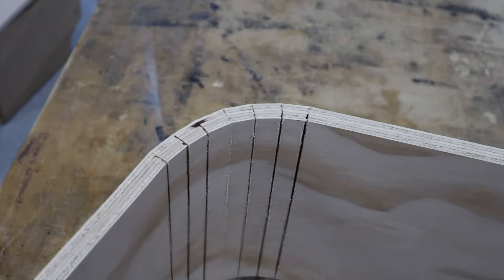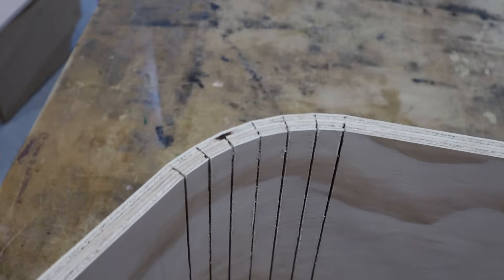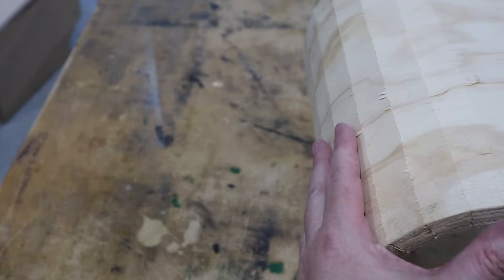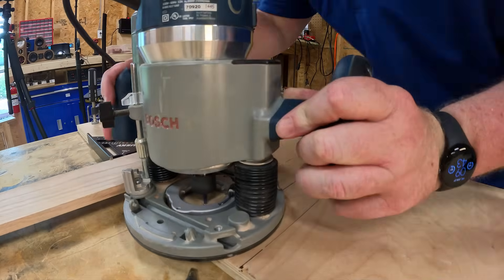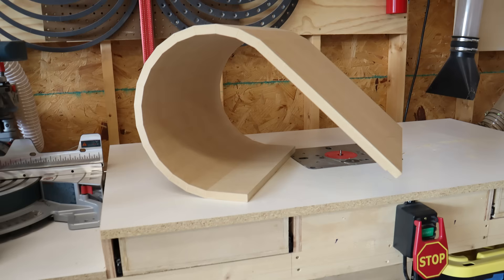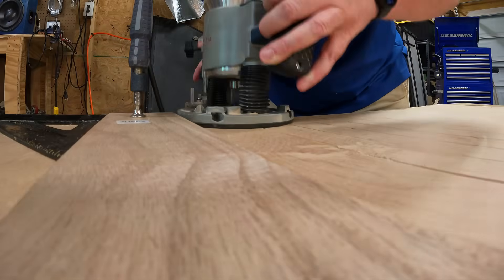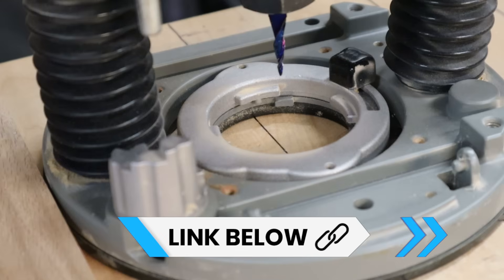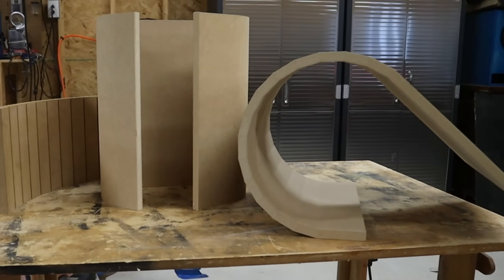I made seven cuts but I think I can get away with six, because with seven cuts you bend well past 90 degrees. I'll have to experiment with that off camera. What I love about this method is the way the gaps all close up — when those gaps close up you're gonna get a great glue joint. What I don't like is on the back side it makes these ridges. With MDF you can sand that down; I'm not sure how it's gonna look if you sand the plywood. Why not just use a circular saw? A circular saw makes a straight cut, and when you bend the wood it's gonna leave a gap. That gap weakens your glue joint, so you get a stronger joint using a tapered router bit. Also you've got to make more passes with a circular saw, and more passes means more opportunities to make a mistake. Plus it's easier to set up the plunge depth on a router. And if you already have a router, why not spend a few bucks on this bit? There's a link to the bit in the video description — this bit is an absolute game changer.